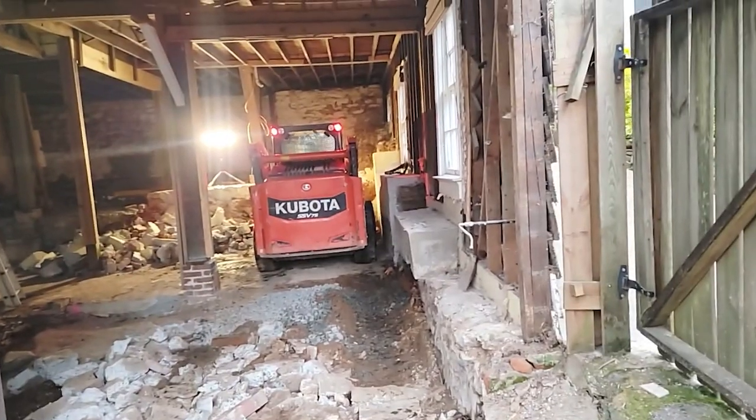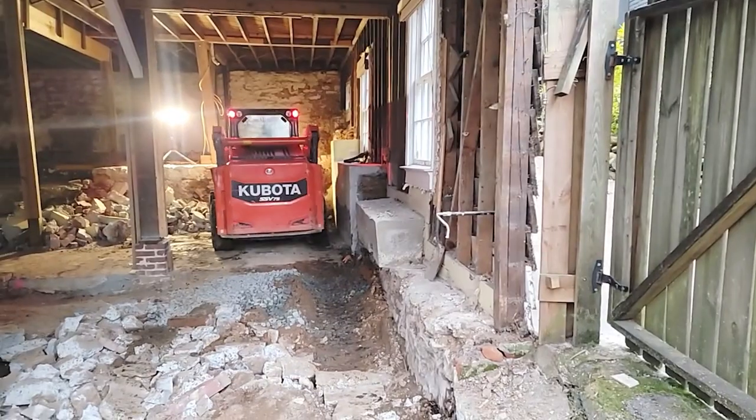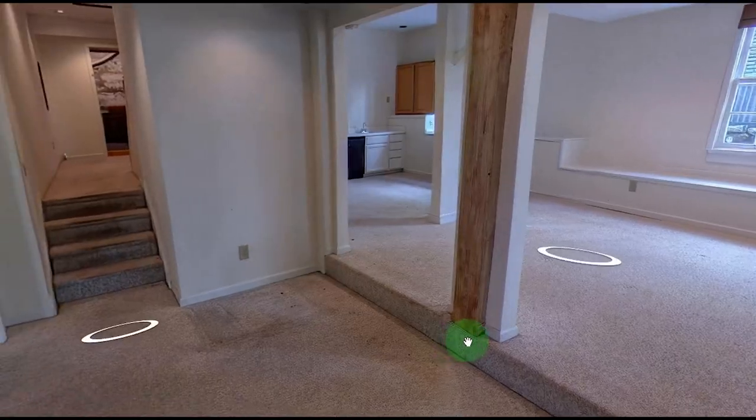Let's look at the demolition phase. We took out everything that was in place — we took out the framing, we took out the foundation wall, and we completely rebuilt the foundation wall on three sides. On the front wall, we decided to leave it and do shotcrete there because if we took that out, the house would have fallen down. Plus we had a front porch we wanted to keep in place. We basically got it down to the dirt — Georgia red clay — made sure everything was compact and got all the debris out.